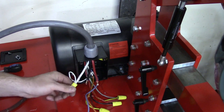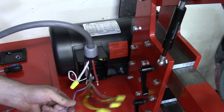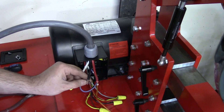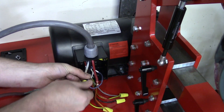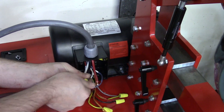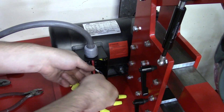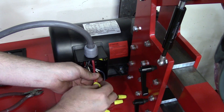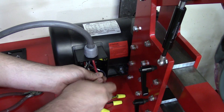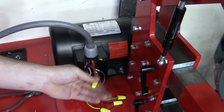The white wire going to my VFD is going to hook to the white wire on the motor — give it a tug to make sure it's in there; if it pops out, do it over. I'm going to put black with line one, since black and blue work together in my mind, and then orange and red together since they're similar in color. There's no real reason for this — the key is making sure they go to the correct lines.